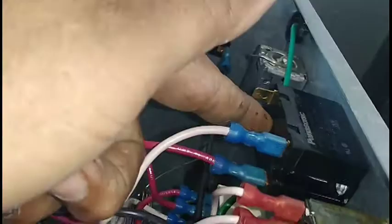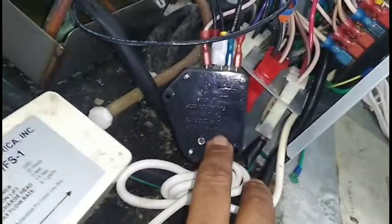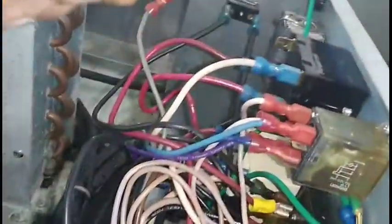So all I have to do is just wire it in, which is up here. There's 2 wires I have to put. This one goes to the in of the thermostat, and the one that goes out of the thermostat goes to this coil here. If I turn it on or off, we'll do a test when we do the final test, but nothing should come on, only the evap fans. This is a normal cycle, not defrost. I tested both cycles; they do cycle, so I would have to just leave it running and see how it acts. So I'm going to connect these up, and then after I connect these up, I'll show the whole connection.